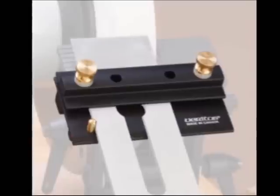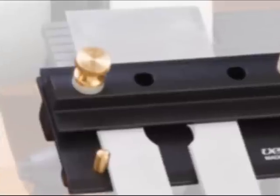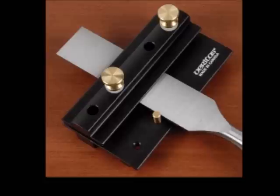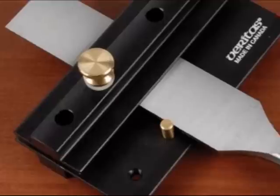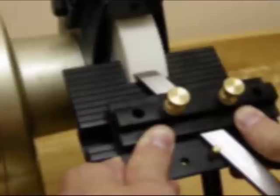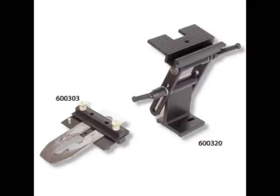To make a really accurate wooden grinding jig, it's going to be bulky and it's going to take some time, plus you're going to have to buy all the hardware. So at $25, buying the Veritas grinding jig was kind of a no-brainer for us instead of making one. The best part about this jig is it's self-aligning — moving a couple of brass pins can accommodate different sized chisels and plane blades and still keep them perfectly square to the stone. By moving the lower pin to the center position, you can also do a 30-degree skew on chisels and plane irons. It's designed to slide back and forth across the wheel in a slot in their separately sold tool rest — a feature we're going to take advantage of in our tool rest. Not only does our tool rest design have more features, but it's a lot cheaper than the $60 Veritas wants for theirs.